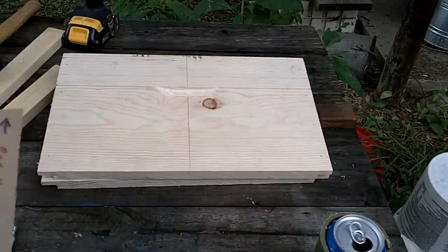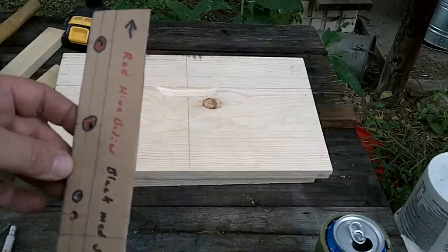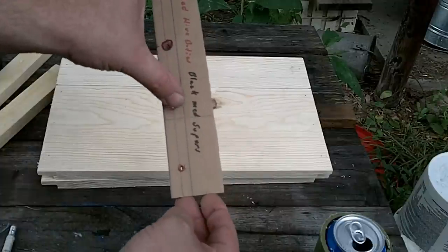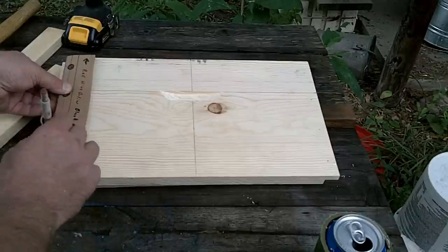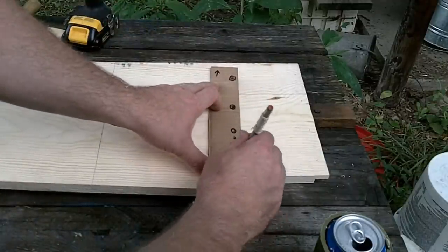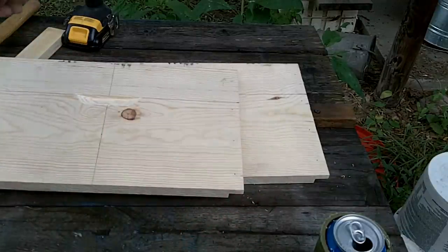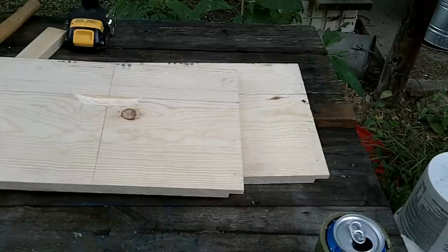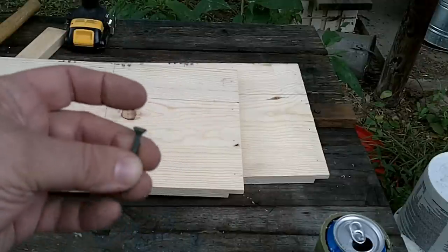The next jig is for the screw holes. I split this jig up — it's set up to make screw holes for a medium super, or if you use the entire thing, the red holes are for hive bodies. All you do is set it right down on your frame, take a pencil, mark the red holes, flip it to the other side, and mark the red holes again. Put your screw where the dot is. I always use a drill bit to make a pilot hole first, then send in my screws. I use these little inch-and-five-eighths torx-head decking screws — they work pretty well.